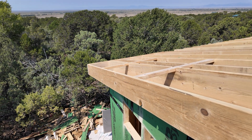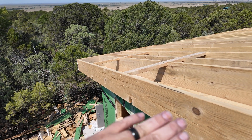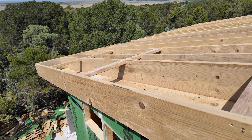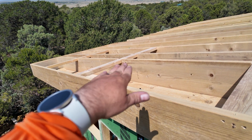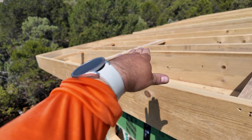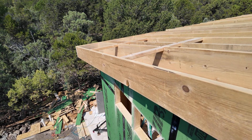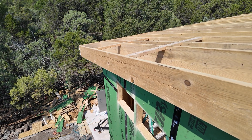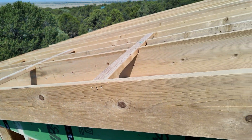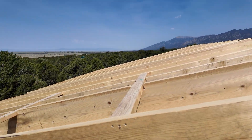Back up on the roof - let me show you what we did up here. We got this side piece on with a couple extra boards on the end that held it in place while I nailed it. Then we cut out two pieces of the rafters so you can put a 2x4 along there and kind of cantilever some of the weight, which makes this super strong and rigid - it's not going anywhere. That's really important with the snow loads we get, and also since I'll be up here doing shingles, I don't want to fall. I've got those every 4 feet, so this overhang side is basically done.